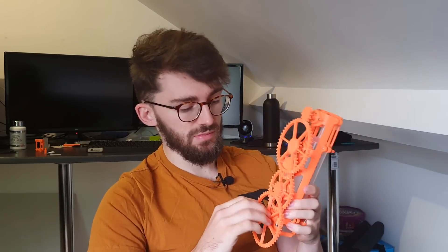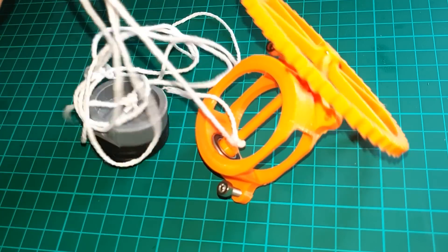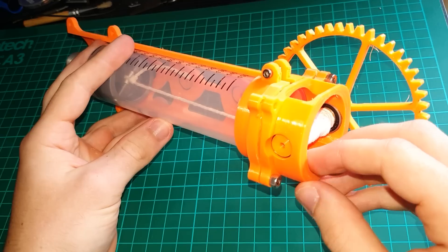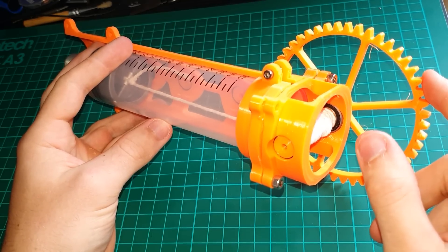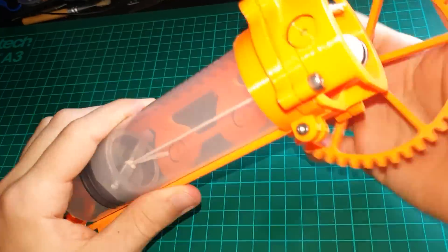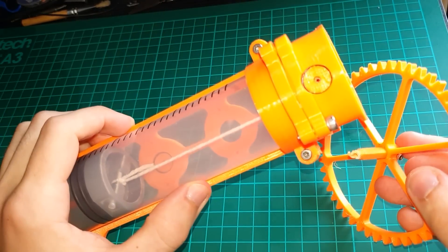It's actually really fun to just play with the gears. So before I go any further with this, I'm going to test it under load to see if anything breaks — because something always breaks. So now I'm just going to test whether the string holder and the gear are strong enough to pull the piston up. That's clearly not going to work. So I've increased the diameter of the reel as much as possible while still allowing it to fit into the bearings.